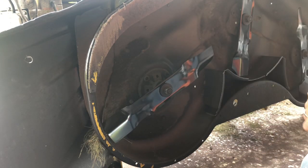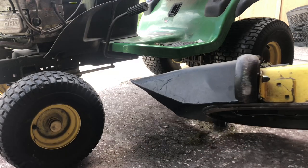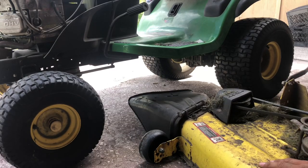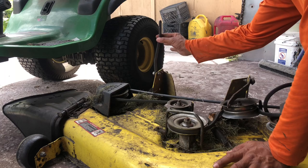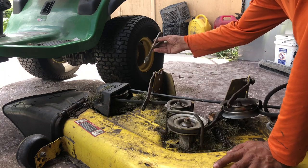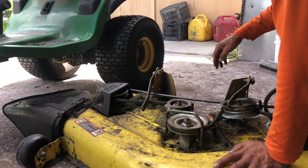Nice new blades put on and we're putting it back together now. Again, 10 to 15 minutes. Use your wheels, push them into place. Remember what I said about these units — make sure these are facing inwards, because once you get that in you can't raise it up because it won't go past the deck. These are okay because you can take these off and put them back on how you want them.